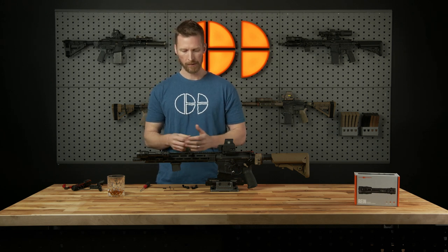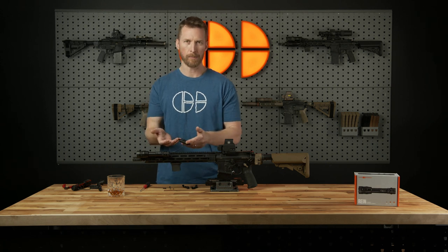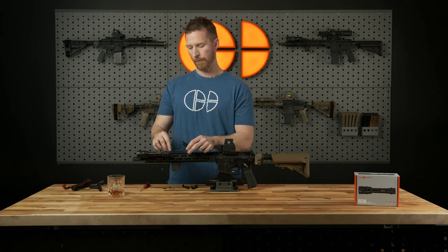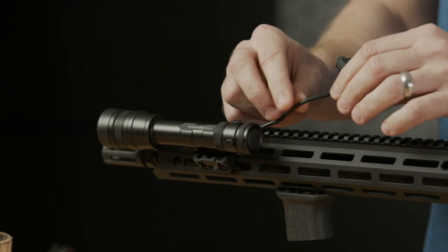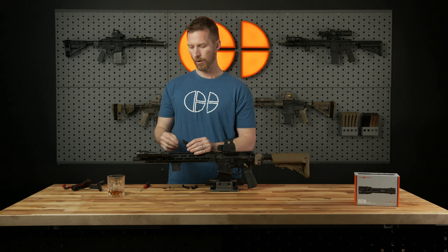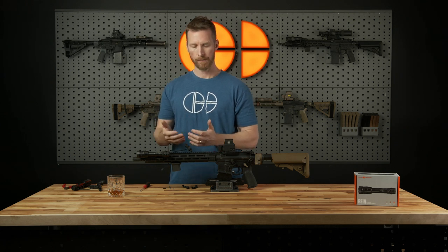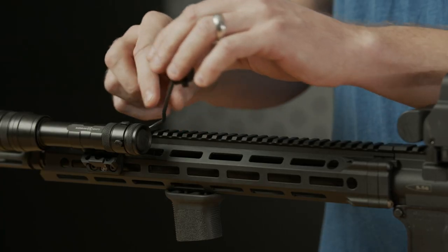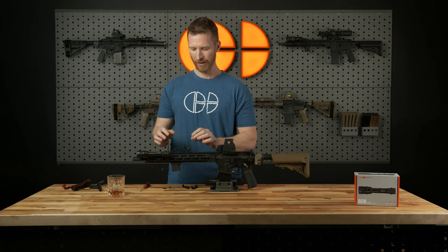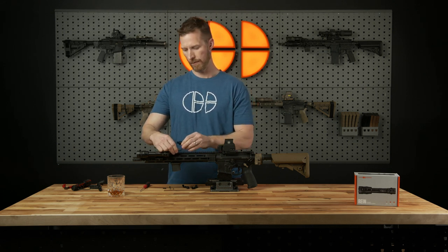If there's a challenge that comes with it, it's just the orientation and figuring out how you want to set up your gun — everybody's different and there's no right or wrong. One thing to note is that the cable is a little bit unique. Like I said, it's six inches long, which is pretty much industry standard. However, it's a lot stiffer and more robust than other cables. We did that for two reasons: first, we run a lot more power through the system to get the performance, so the cable just had to be bigger and thicker to handle that much amperage. The other hidden benefit is that it has a very real amount of memory to it — once it's positioned, it doesn't move on you.